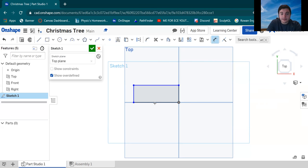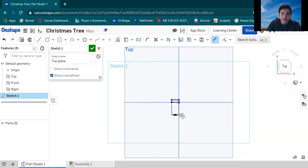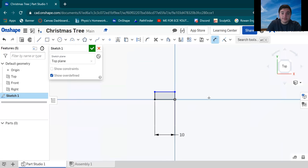Hit the bottom line over here and drag that out. This is just telling you what the measurement is — you can place it in any orientation you like. I'm gonna change that to 10 millimeters. Since you already declared your workspace units you can just type 10 without specifying millimeters. Hit Enter. Now it's gonna make that box real small. Now take the dimension tool again on the line parallel to the y-axis and drag and drop it right here.